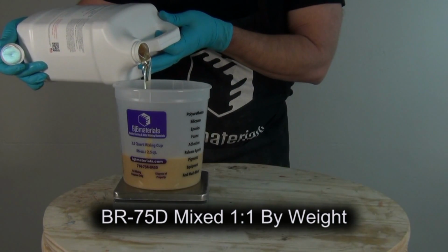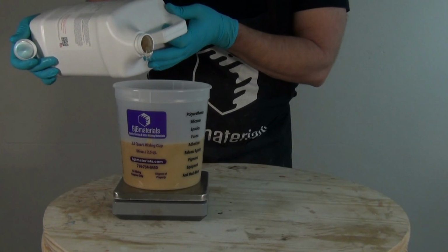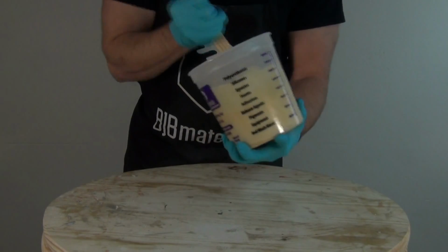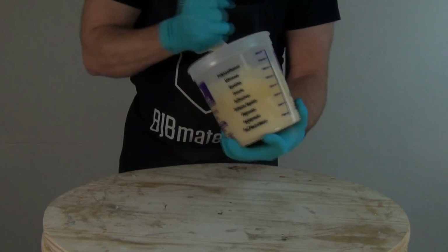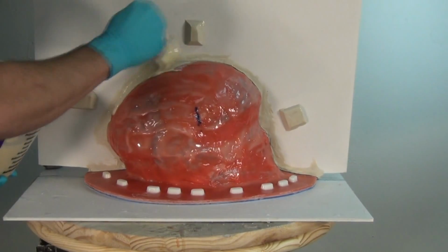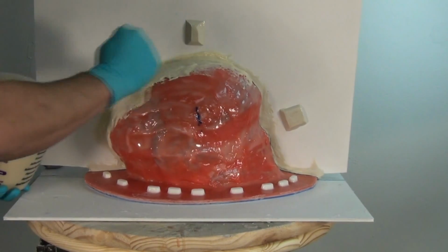Now, when we mix the two components together, they're going to thicken slightly to form a brushable paste. Now, the way it is naturally right out of the kit, you're going to wind up with a paste consistency that's kind of a light paste consistency. And it's ideal for this first coat. I typically do a mother mold like this in at least 2 coats, because this first layer has a little bit of a sag to it, and this is perfect for getting in around those key forms and any detailed areas we need to get it into. And then later we're going to come back with another batch that's going to be thickened up with FiberThick to make it a really thick frosting-like consistency.